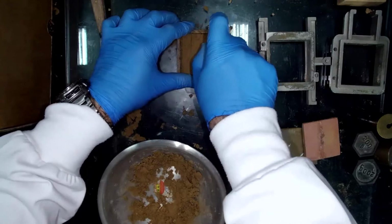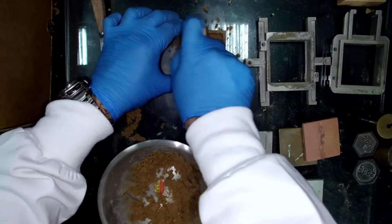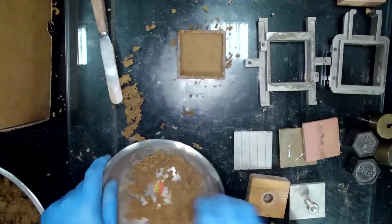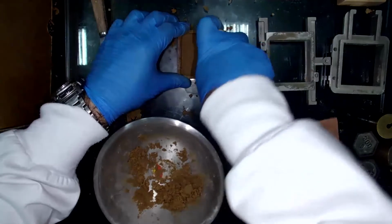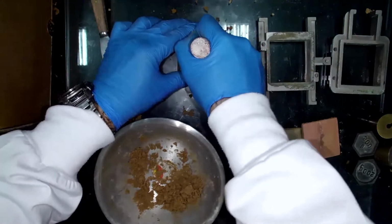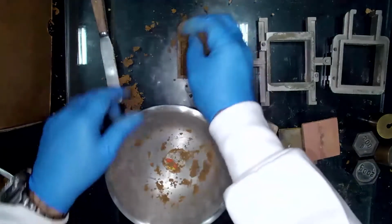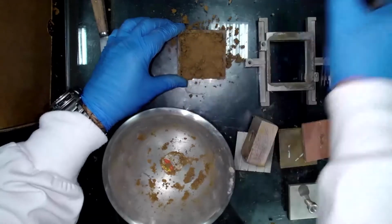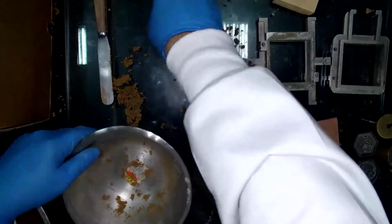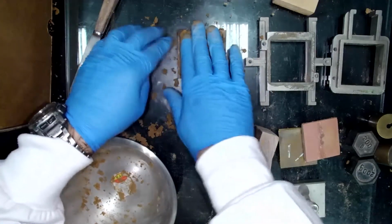Specimens may be molded by either kneading or tamping each layer until the accumulative mass of the soil placed in the shear box is compacted, reconstituted to a known volume, or by adjusting the number of layers, the number of tamps per layer, and the force per tamp. The top of each layer shall be scarified prior to the addition of material for the next layer. The compacted layer boundaries shall be positioned so that they are not coincident with the shear plane defined by the shear box halves, unless this is the stated purpose for a particular test.